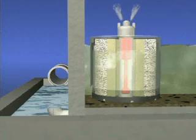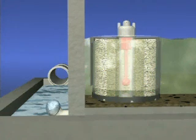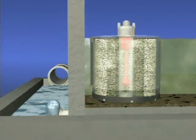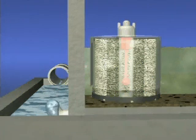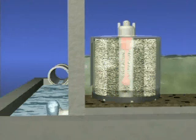When the water in the cartridge reaches the top of the float, buoyant forces pull the float free and allow the filtered water to drain out into the underdrain manifold for discharge. At this point, the air relief valve closes to create the siphon effect, which increases the flow potential and distribution of pollutants across the filter media.